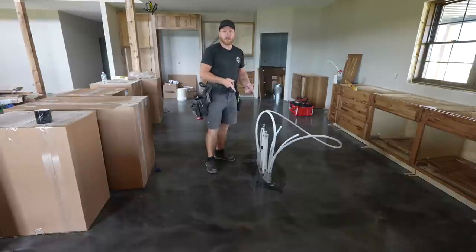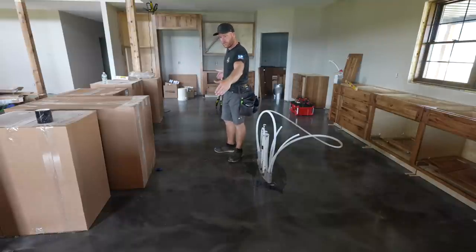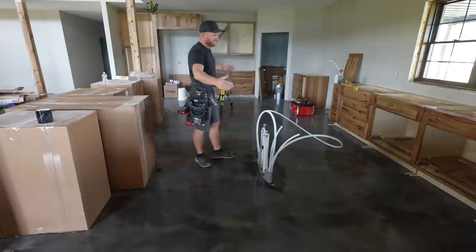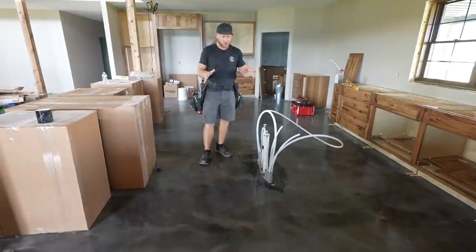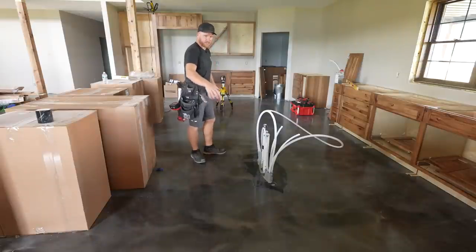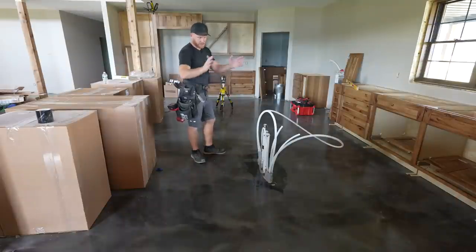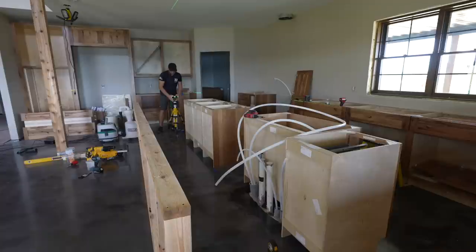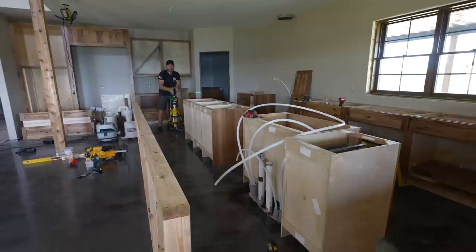These pipes are an indication that we've got an island here. I've got the last of the cabinets still boxed up - this is a 13-foot set of cabinets, but the island is even bigger. We've got a 5 by 17 foot island that you can sit all the way around. I need to get some marks on the ground to figure out where it's going to go, build a wall because there's going to be a supporting wall that all these cabinets get mounted to. I've pulled measurements off the walls and laid some blue masking tape to give me a reference point.